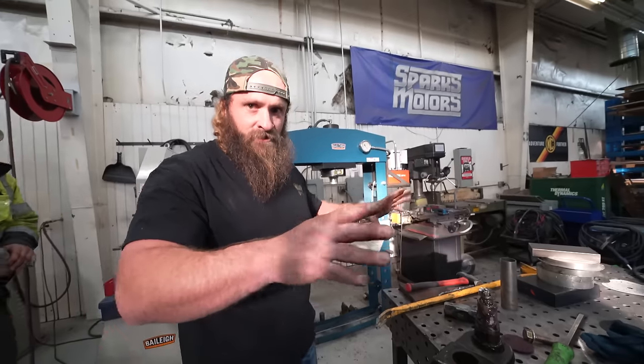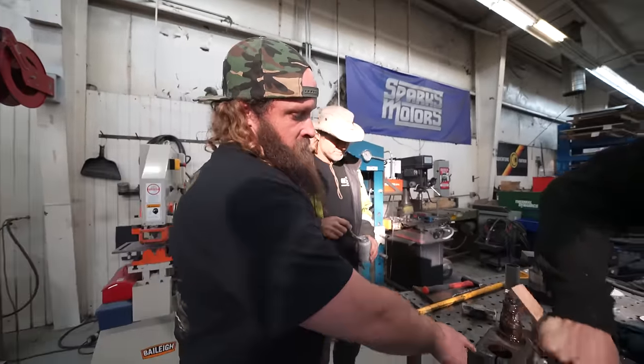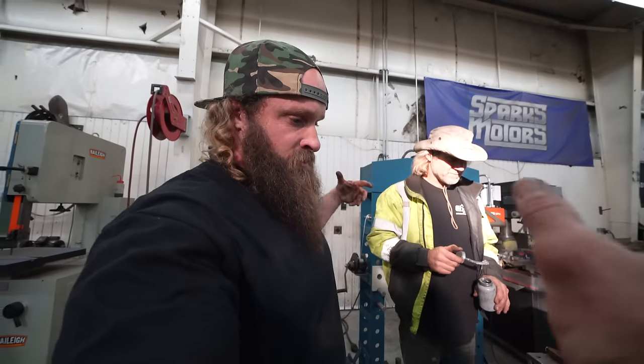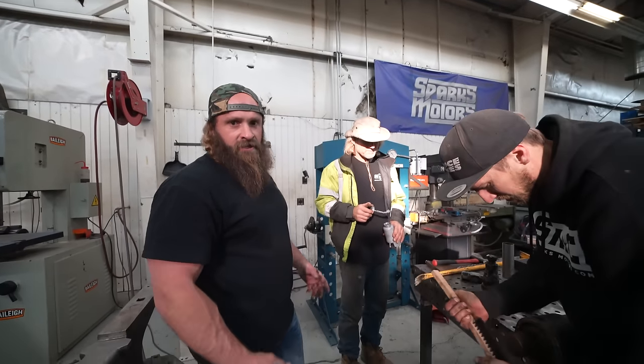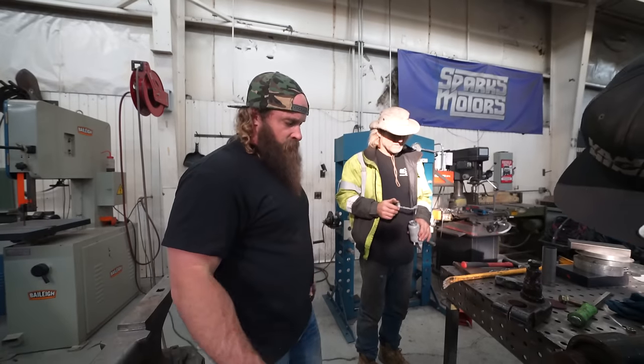If you look at the track assembly, you have the two wheels right in the middle. They're being held on by this. Basically, this goes on, you mount your two center wheels to it, and then your gears are on the outside and your track spins around it. And that's to mainly keep the track on. It'll be your guide wheels all the way around.